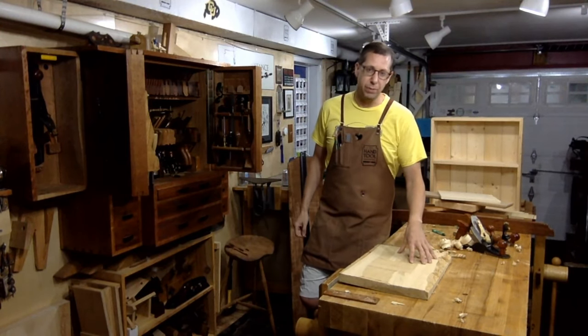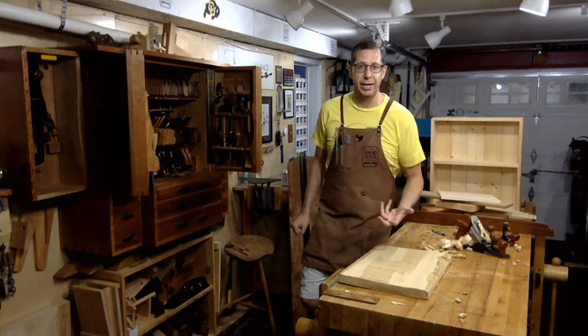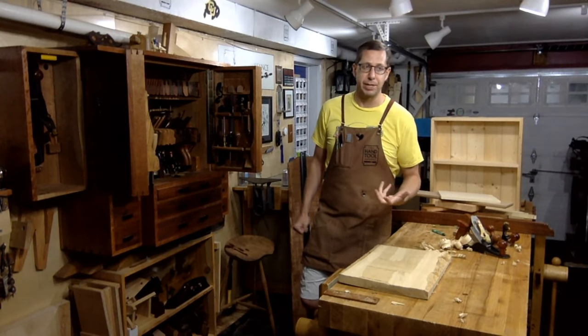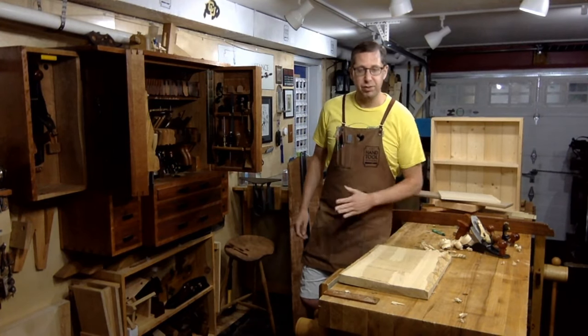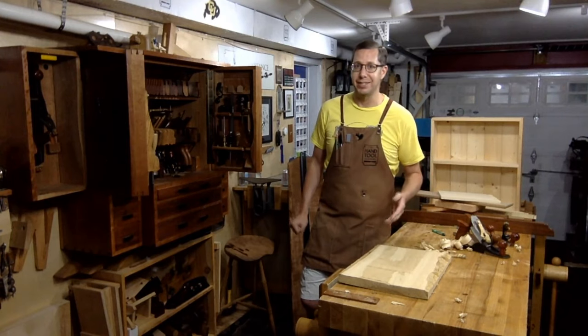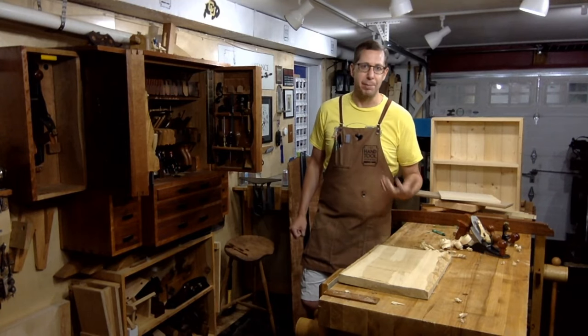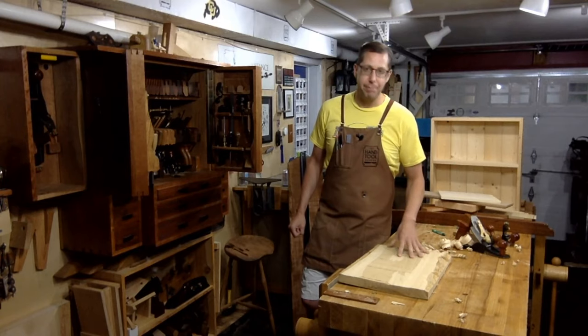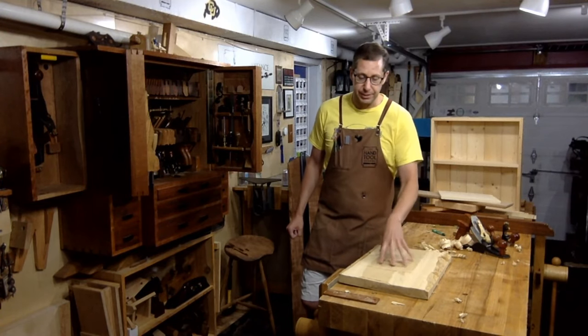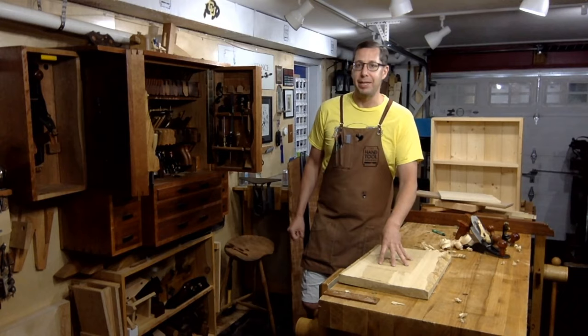And when you've got a drawer bottom that's usually a half an inch thick, sometimes I tend to make my drawer bottoms a lot thinner than that, it's real easy to flex that thinner board. So the level of flatness required there in many instances isn't that flat, because the drawer groove is just going to flex out that possible cup that you have. So again, the drawer bottom in this particular instance may end up needing to be more pretty than anything else.